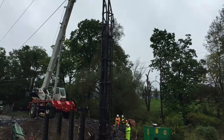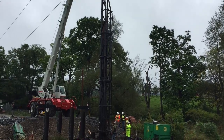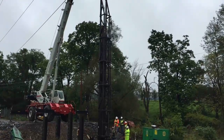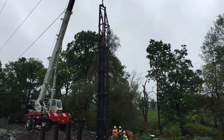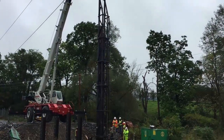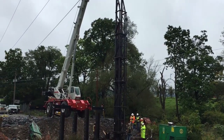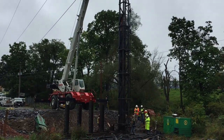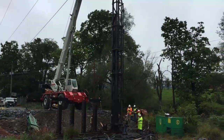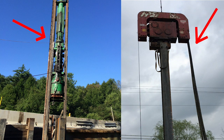In this video, we are going to discuss the pile driving process for structural foundations. Pile driving is the operation of placing a slender column into the earth by means of hammering or vibration to achieve a required resistance for the support of structural elements. Piles are used to support vertical and horizontal loading and come in many different kinds. There are two main types of hammers used to install piles: the drop hammer and the vibratory.